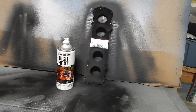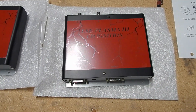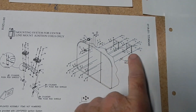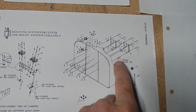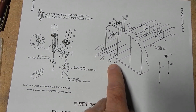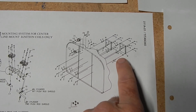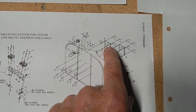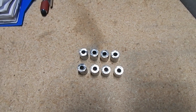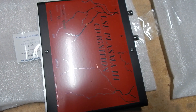I'm spray-painting that coil bracket with some automotive high-heat 2000-degree spray paint. The next thing I'm going to do is put these ignition boxes onto the firewall — they mount on the inside, and it looks like one of the bottom corners of each goes into the welded tab of the frame. There are two different size bolts you have to use — AN bolts — one that goes through the frame, and then there are some bushings that separate the box a little bit from the wall, so you have to cut some bushings. My eight half-inch bushings are ready to go for spacing the ignitions away from the firewall.